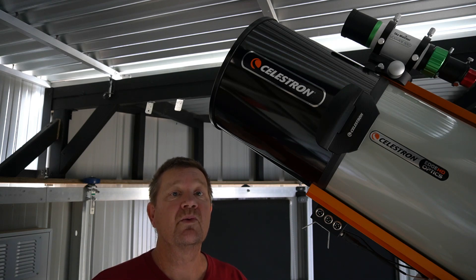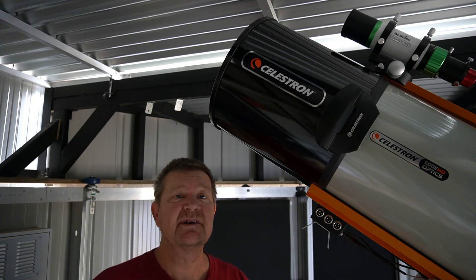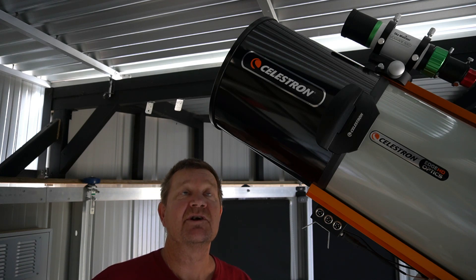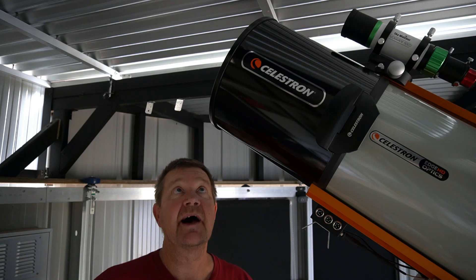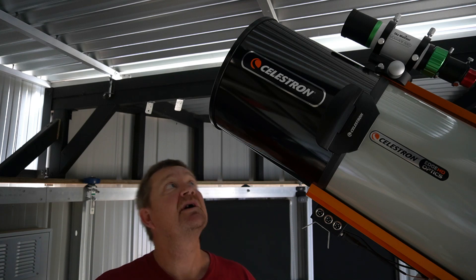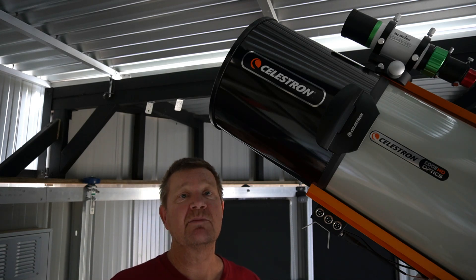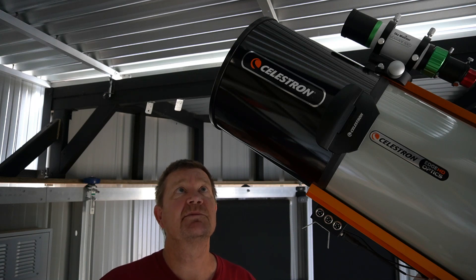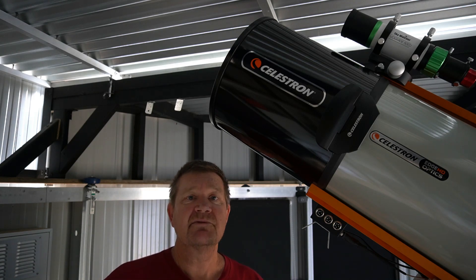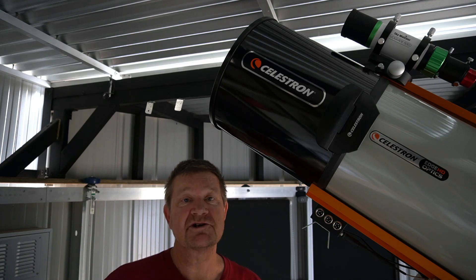I decided to go with a vibrating multi-tool to cut through the aluminium. I did a couple of little tests — I didn't want to use an angle grinder or try to saw it; it was a bit of a rough job. I didn't want the heat from the angle grinder, so I thought that was the best tool I had at hand. I got all the fine particles out okay — I was surprised, I expected it to be a lot harder. I put it into some sunlight to make sure I got all the last particles. The rubber ring went back around okay, and I'll probably get a little bit of glue to touch up a couple of places just to keep it on. The lid fits nice and snug again, and I'm pretty happy overall. If you got this far in the video, I really appreciate it — thanks for watching, and I'll see you in the next one.